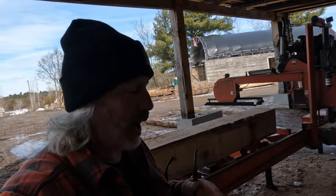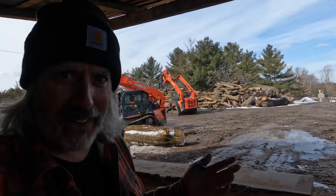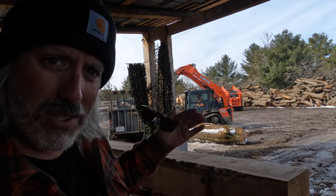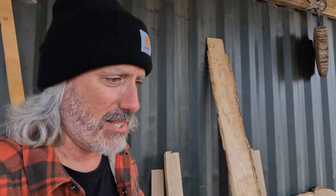So we were just talking with Brian. He's got this kind of somewhat squared up now, but he's still basically chasing lumber out of this, is what they call it, I guess. So they're just trying to get all that wane squared off so that when they actually do the cuts for the actual stair treads, it will be like true lumber. So this is incredibly interesting.